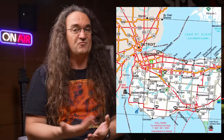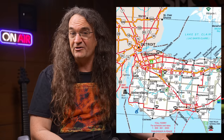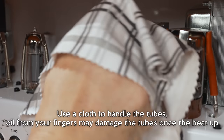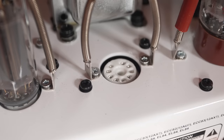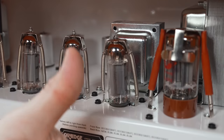Warren and Cameron were looking at each other like, how the hell did he pull that off? I explained that because Windsor is such a small city, we don't have many amp techs, and if you find one you'll be waiting months because they're backlogged. So you have to learn basic maintenance on your own. Changing a vacuum tube is super simple: make sure your amp is powered down and cooled off, pull the tube out by rocking it back and forth slightly, grab your new tube, make sure the pins line up and pop it in. Having a spare set on hand in your studio is a great idea.